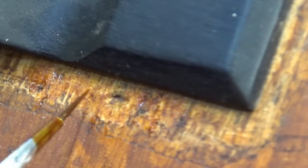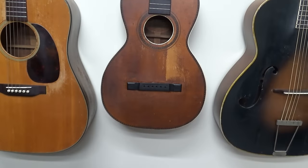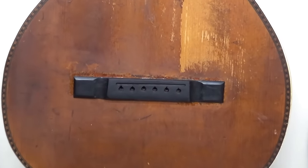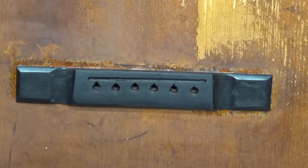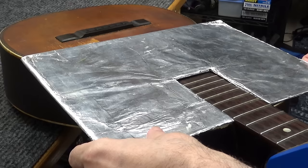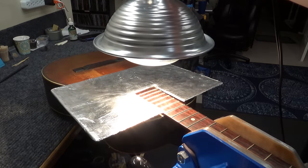This shellac is super thin — Zinsser spray shellac — I can go over it a couple of times and it won't build up thickness. There is a divot here I'll want to fill. After just a few minutes, I think the color is really good. The shellac is still wet-looking, but I can come back tomorrow, put a little clear finish over the color, and hit it with some synthetic steel wool to dull it down. Also — what a wide fretboard on this guitar!